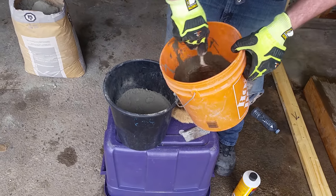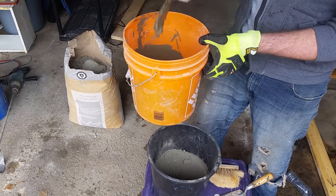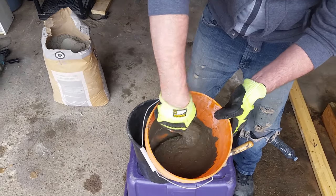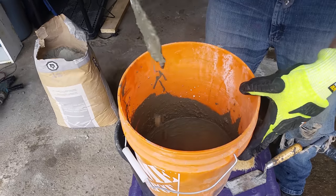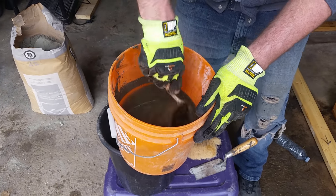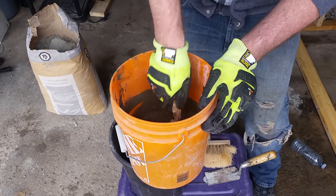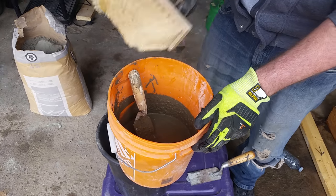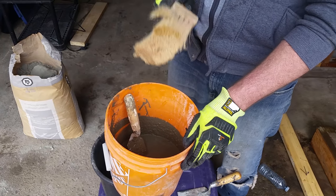I've got something that I think is pretty good here. As you can see, it's almost self-leveling — a quite liquidy product. I'm going to spend another couple of minutes, maybe use my drill and whip attachment, to get all this Portland fully broken down. Once you've got it all creamy and mixed together in a consistency similar to what you see here, you take your brush, dunk it in the slurry, paste it onto your old damp concrete — and that's how you make a bonding slurry.